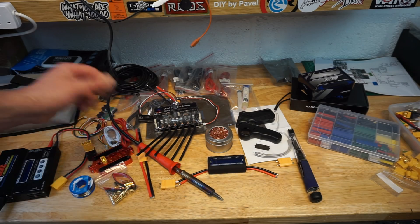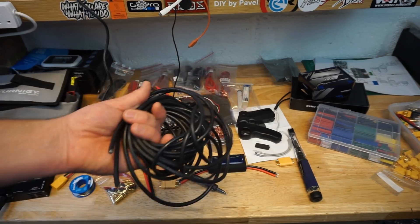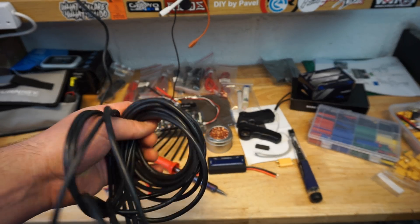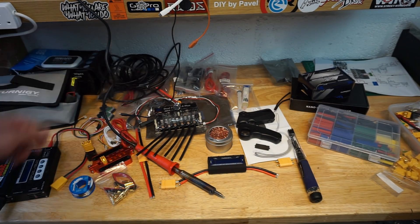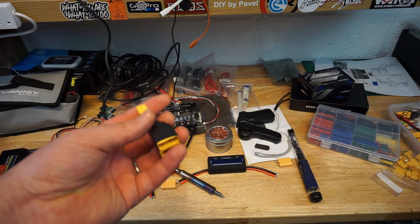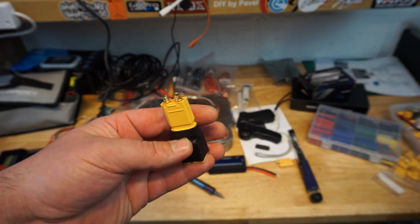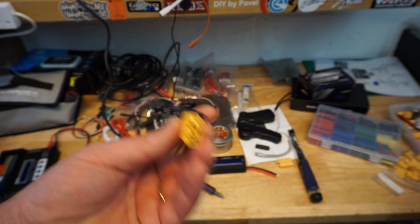You will also require some cables. Because I'm going to run my board at 65A per motor, I've decided to go for 10 gauge silicone high temperature cables. You will also need series connectors. Because I'm going to use two LiPo batteries, I decided not to fiddle around with making one — you can do that if you want — I just bought an adapter straight away. It's quite cheap.